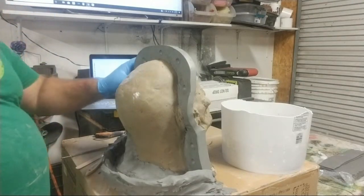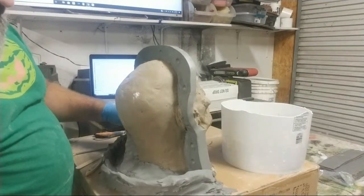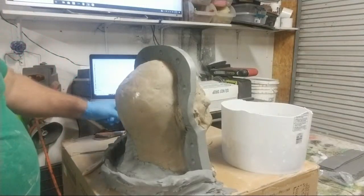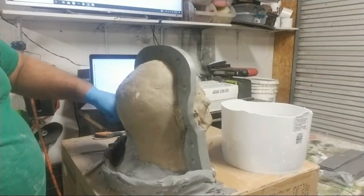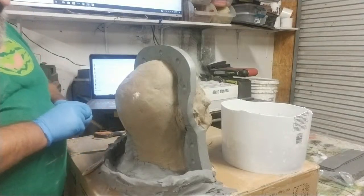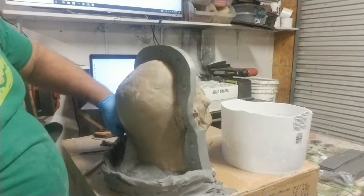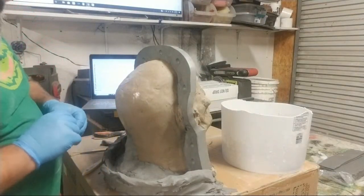All right. Double checking my mold wall before I commit it to plaster. It's pretty good. It's fairly smooth, not a lot of tool marks in it. I have one little weird area over here. I think I can clean that up right now, though. It's actually beyond the point of the sculpture, so it's not a big deal. But I just want the mold wall to look fairly nice and not have any spots where it's going to lock up. This half should not really lock up, but you never know. So down here in that corner, in case that corner kicks out a little bit, put a little clay right there to make sure it's level with the wall.